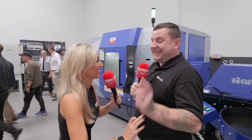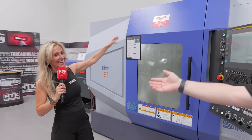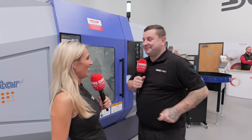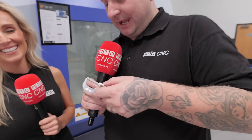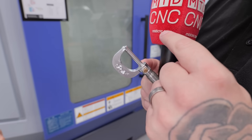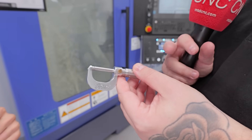This doesn't look like a sliding head because it's not — it's a fixed head machine. Star have gone into the market with fixed head machines. If you're a Star user, you've got that interoperability from your sliding head machines over to your fixed head machines. On this machine they are making this end part here, which is quite unusual — a lot of prismatic components that you wouldn't typically put onto a turning centre — and that's exactly what these machines are capable of.